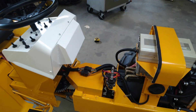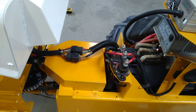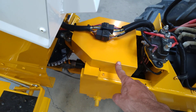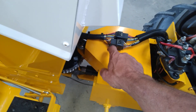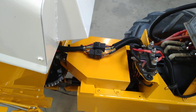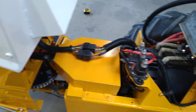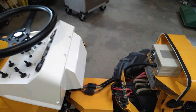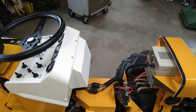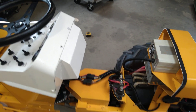Moving back from that, this is my reversing contactor for the winch. Underneath here is a 12-volt battery — just out of a lawn and garden tractor, just a little lead-acid battery. And up here is a fuse block for the various systems. There's a fuse for the controller and just everything — anything that has power going to it should have a fuse on it. That helps save your wiring harness if something goes wrong, and it can also help you diagnose problems when they do.